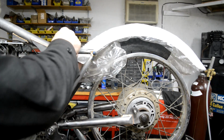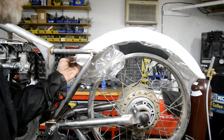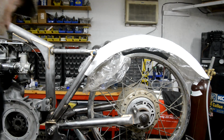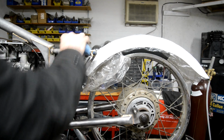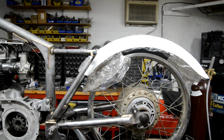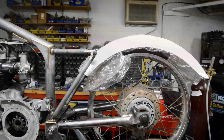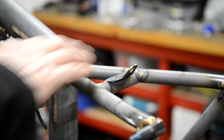Right, so cross piece, mount, loop, double mount. Yes, that's what we're going to do. So that's where that oil went that I saw dribble out. So let me cut a little piece of tube to fit in there and we'll bronze it in and then we'll make a little bracket. We'll get that centered. So there's our cross piece and bracket.